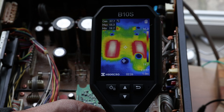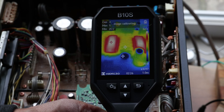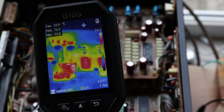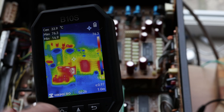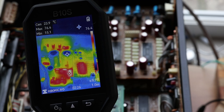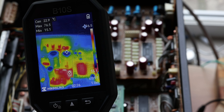The main thing here is finding any components running super hot. We know those chips run around that temperature, so they're running perfectly fine. If we step back a bit and look around, we can see there's one part running at 76 degrees Celsius. It's still within the norm, but it's good to know. As long as you're under 85 degrees, you're usually fine — most components can handle up to 85 degrees, and some are designed to run hot.